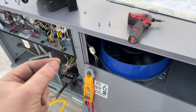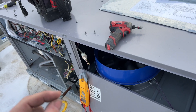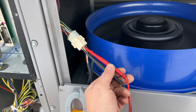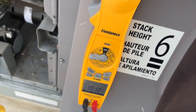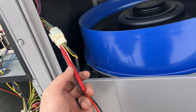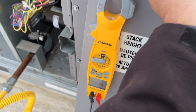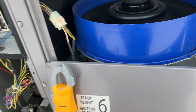So gray to white is communication, and orange to white is 10 volts DC. The communication signal is going to be between 2 and 10 volts DC. Checking between orange and white — we're receiving 10 volts DC. Now checking our communication line, gray to white — we're getting 9.2 volts DC, so it is calling and it seems like it's almost full blast.